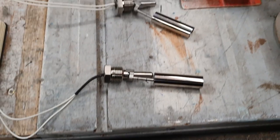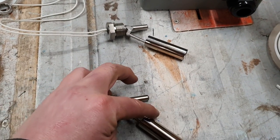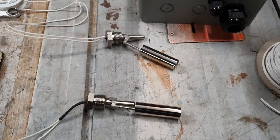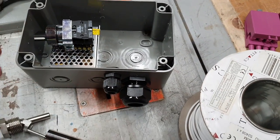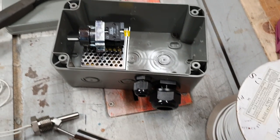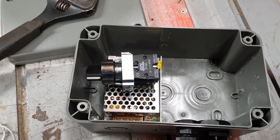Very simple latching relay — used to turn on the pump when it gets to the top float switch and off when it gets to the bottom. That's all we're doing here. I'm going to go forward now and start to wire this up — I'll probably wire it up outside the box and then drop it in and maybe hot glue it into place — and I'll do that off camera and then we'll talk about the wiring.